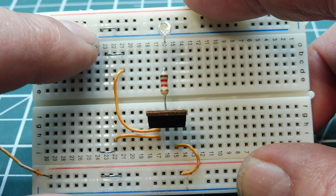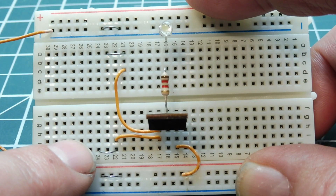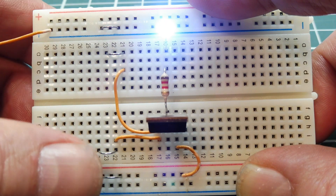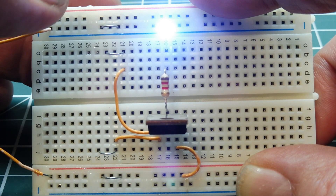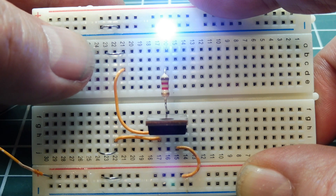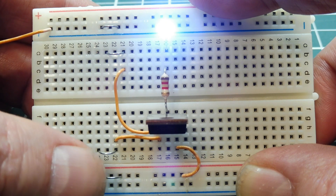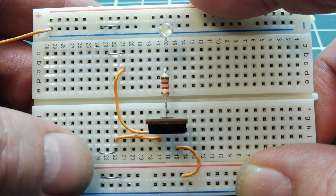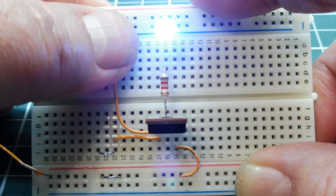I have two touch sensors and two jumpers up top. The top one is my on touch sensor and the bottom is my off touch sensor. If I bridge my fingers across the top sensor I can turn on the LED, and if I touch the bottom one it turns it off. On the top one I'm bridging VCC over to the gate of the MOSFET, charging up the gate-to-source capacitor internal to the MOSFET, and it turns on the MOSFET. When I touch the bottom pads I'm draining the gate-to-source capacitor and shunting it to ground. It's very sensitive — I just have to charge up the capacitor to turn the LED on or off.